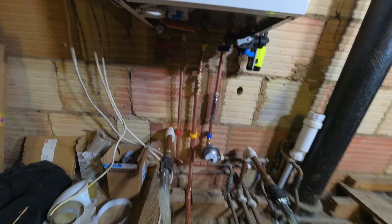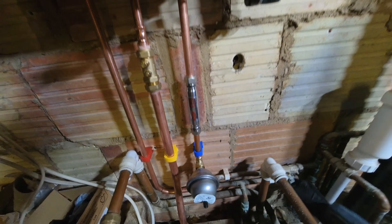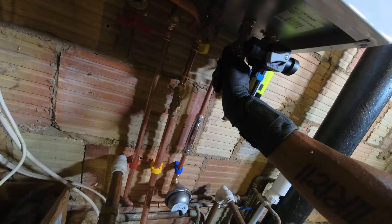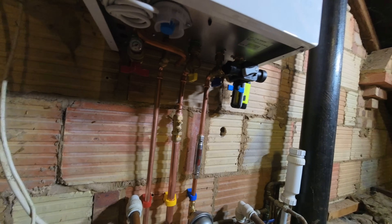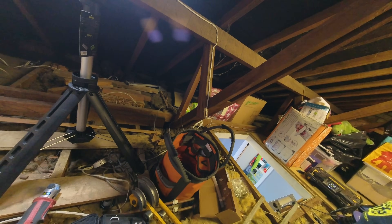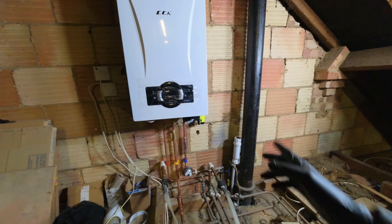Hot, cold and gas are all done. Turning the cold on — so far so good, no leaks at the moment. I think Josh has got a tap open downstairs — you can hear the water running. The power flush has finished doing all the circulation for each of the rads, so now we're going to start dumping. Josh wants me to get the hot done because he's filling it through the shower — mixer shower — in case there's backflow through the hot. That's done. Now while Josh is dumping, I'll crack on with the wiring, the PRV and the condense.